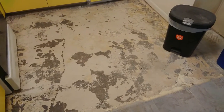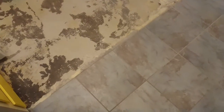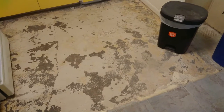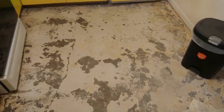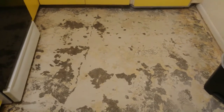This is how you take up tile with just a few basic tools: your small hammer, your crowbar, safety glasses, and gloves. I still have to remove all the tile in the rest of this area. I'll update as we go, but I wanted to get this video out there for those of you who want to DIY removing old tile. I've still got to remove the adhesive off the foundation and then see if I need to level it, but based on touch, walking around, and basic measurements, I think we should be good to go.